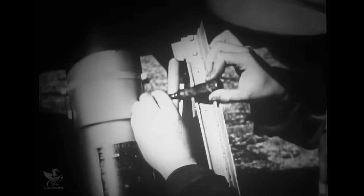Now is the time for pre-flight adjustment and inspections of the landing gear shock strut. First, all of the air is released from the lower chambers to allow the strut pistons to be fully bottomed. Next, we remove the plug on the lower chamber to see if it contains the proper amount of fluid. If there is sufficient fluid in the cylinder, it will be found level with the plug opening.